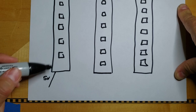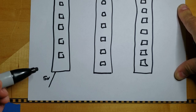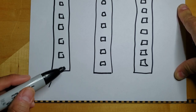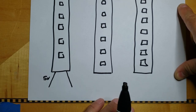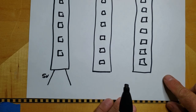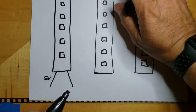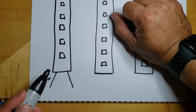And remember, these LEDs are super sensitive. 5 volts is the maximum. Don't try to push 6 volts, 7.5 to them, because you're going to get some very unhappy LEDs. These LEDs are not going to blow up in smoke like other components will. They're just going to fail, and you're not going to know why. You're just going to sit there scratching your head wondering what happened. So you have to be very careful when you're working with them.